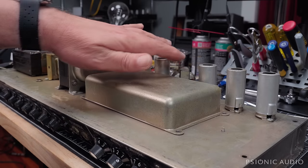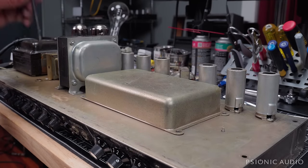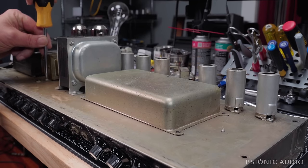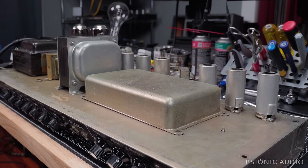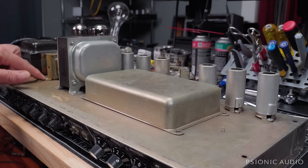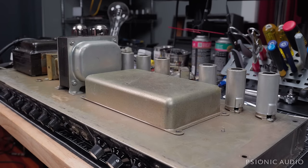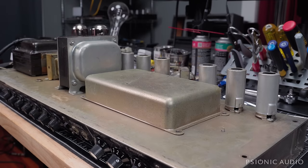The iron all dates from 1964 — that's good. I'll go through here and make sure all the screws are tight. That one wasn't tight on the choke. If you have any amp, maybe once a year check that all the screws have stayed tight and make sure all your input jacks are tight. You can prevent a lot of problems — if a screw comes loose, flanges get damaged, things can bang around, and wires can break. It doesn't take very long, and you can even do this with the amp in the cabinet in a lot of cases.